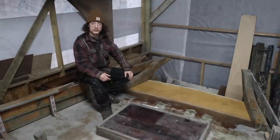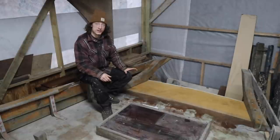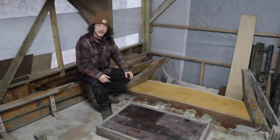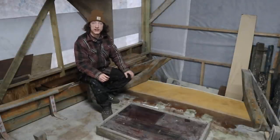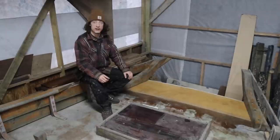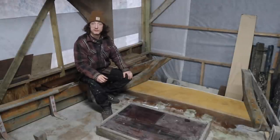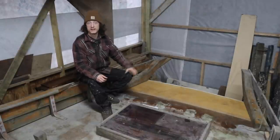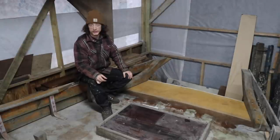And some of you might be wondering why I'm unable to reuse the original knees off the boat. If any of you can remember back to when I dismantled the transom, I showed that all of the transom knees had a defect in them in some way or another. These two outside knees, the port and starboard, have some quite severe shakes and cracks in them. So as I've gone to all of the length so far to rebuild the counter stern of the boat, it would seem silly to refit some timbers that, in my opinion, aren't really good enough for the job.